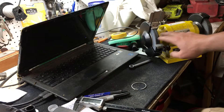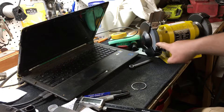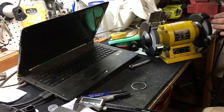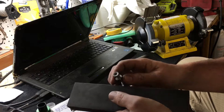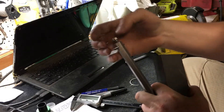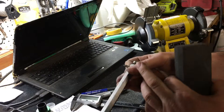This grinder I got for $12 at a yard sale. It's real handy to have a designated grinding stone for my tungsten rods — I work a lot of aluminum so this wheel only gets that use, that's what that groove's for. And this is my lathe sharpening wheel — I only use it for high speed steel, and all the other work gets done on a 9-inch grinder off camera. This may seem tedious but I have a lot more control, and my goal is to keep this parallel with the bit, with a little bit of relief towards the back so it doesn't bind when I feed it into the piston straight in.